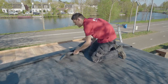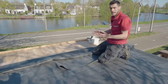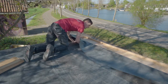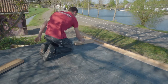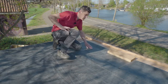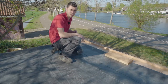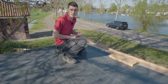We're leaving around 15 to 20 centimeters bare for the contact adhesive. This is the best way to ensure that the roof remains rainproof and that the EPDM film doesn't fly up. There's quite a strong wind blowing, so we're keeping the film in place with wooden blocks while the adhesive dries. Next we fold back the other half of the roll, apply the EPDM adhesive, and then move on to the edges with the contact adhesive.